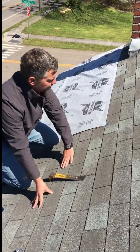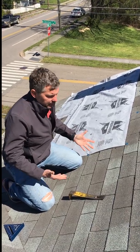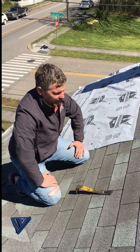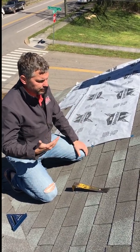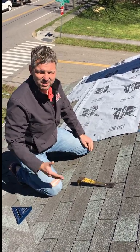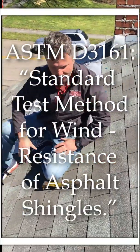We'll go ahead and make a temporary repair to this shingle, but the evidence we're looking at right here is that this roof is not repairable. We would not be able to perform a repair of shingles placed in this area because it would break shingles adjacent or around the area. What we would submit to the insurance company on behalf of this homeowner is that we would not be able to repair this shingle. ASTM says that we can't repair this shingle, and we've got the evidence right here.